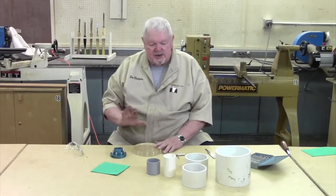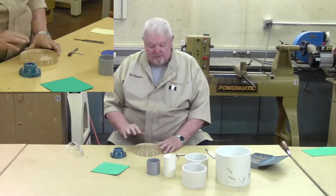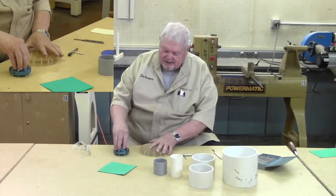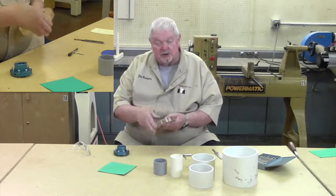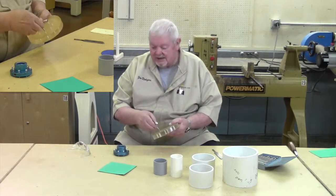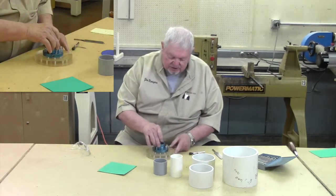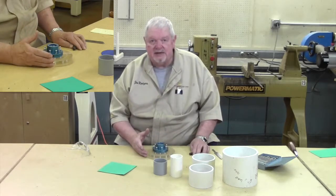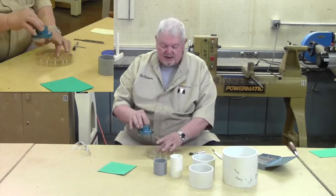I've cleared out those chucks and I want to show you how I build my vacuum chucks. First of all, I'm going to use a commercial faceplate. I'm going to find a piece of acrylic of the right size — I roughly turned this, drilled and tapped these holes, which happen to be 8-32 thread. When I screw this on with those tapped holes, I'm going to get a very tight, vacuum-tight seal at each of those holes. I'm still going to put a bead of caulk around here.